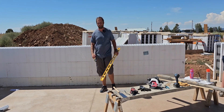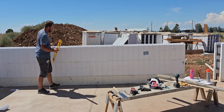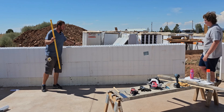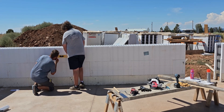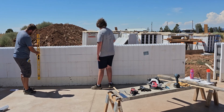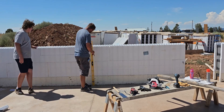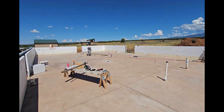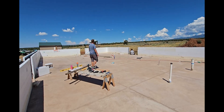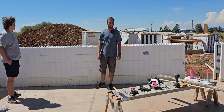If you're building your own house you're going to have your own techniques and different ways to find what you're looking for, but this is what works for me. I want to make sure these foam blocks are nice and firmly pushed down — right there, that's the bottom of the window, there's the side, and there's the side. I'll cut this out, then similarly find all of the windows all the way around the house, mark them in a similar fashion, and cut them all at once.